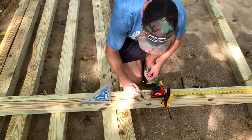Here you can see I'm knocking it in place to make sure it's interlocking with the previously installed plank, and then I'm fastening it permanently with the brad nails. So here we are, and we need to install the first partial piece. In order to cut LVP, you have a couple options. First option is just measure your cut length and then transpose that onto the LVP plank, and then use a carpenter square and a utility knife to score the edge, flip it over, and then snap it along the scored edge.